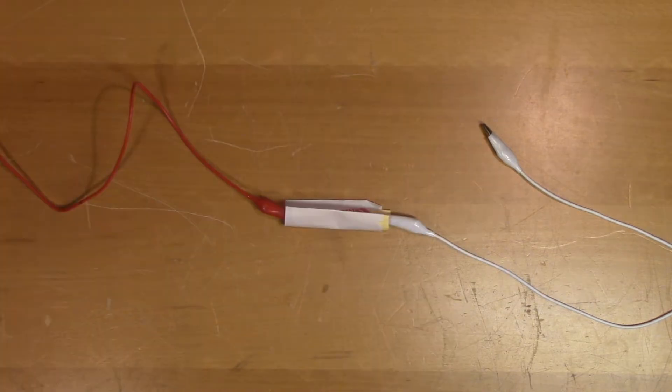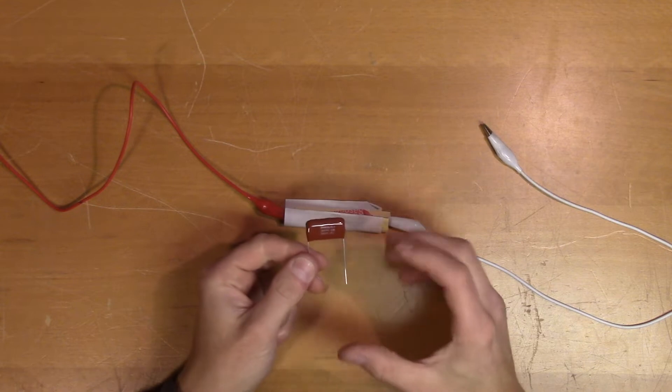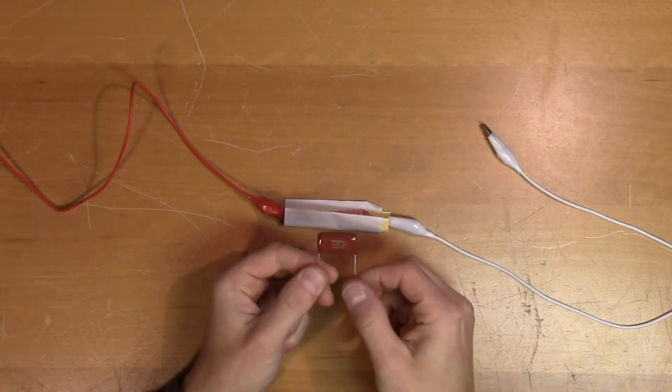That will then act as a shield to the more disturbance-sensitive terminal. Now you could fold these sheets into a more complicated shape to get it more or less completely bi-directional. And I don't know if that's the case for modern surface mount film capacitors, but I'm pretty sure these classic type capacitors are made with a distinct outer shield. But we'll find out.